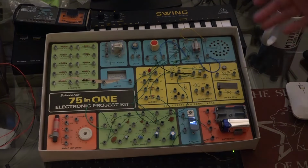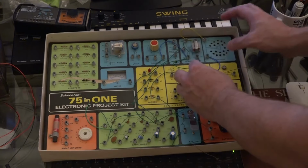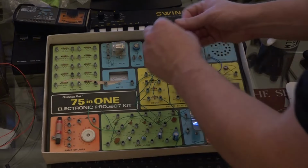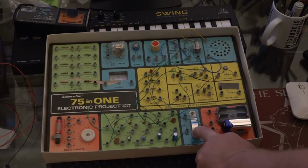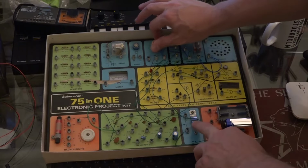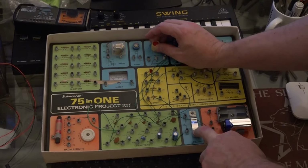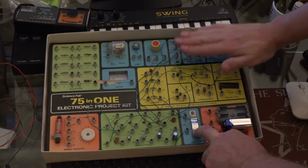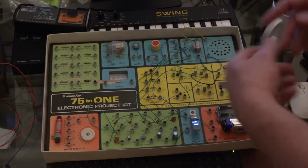Now, because this has got a light dependent resistor on here as well, I had the idea: if we put in series with the pot this light sensitive resistor, then what will it do? Well, it kind of does this. And if you turn the knob up a bit, you've got a wider frequency range. So I think that is infinitely more fun than just having a basic oscillator.